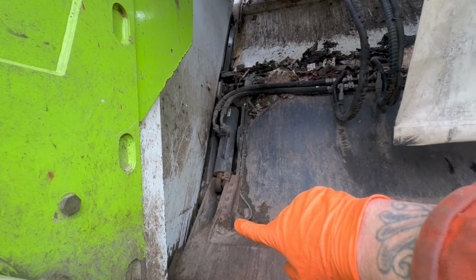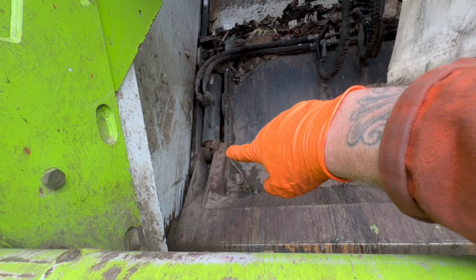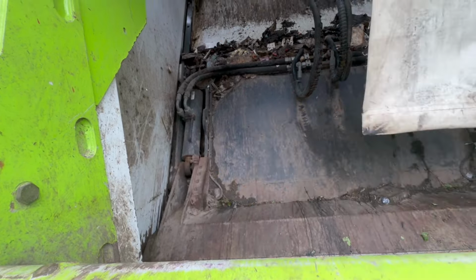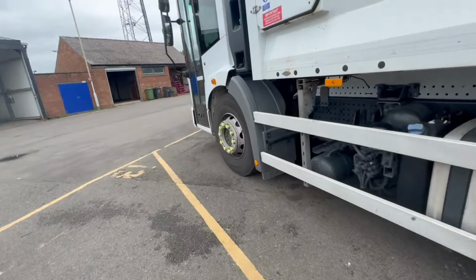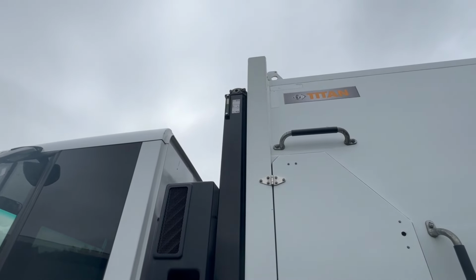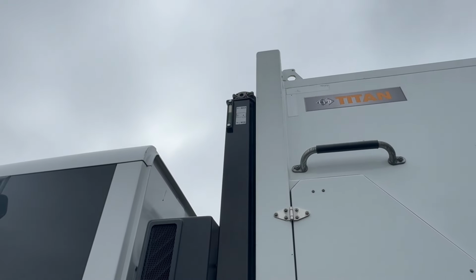Right, so that panel's out at the bottom. That sweep blade's fully open. So every ram is now retracted in. The tailgate ram's retracted, the packer ram's retracted, that one's retracted, yeah? So what that should give me then is a level on my oil tank. So if you look up there, zoom in a bit. Half full. That's the level we're running at, half full thereabouts. So then you've got to allow for expansion of the heat of the oil and what have you.